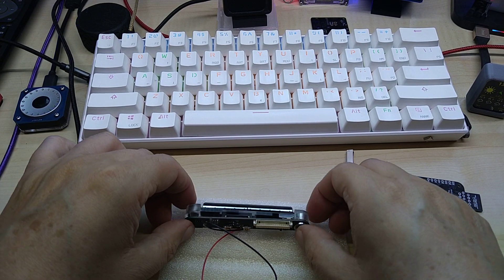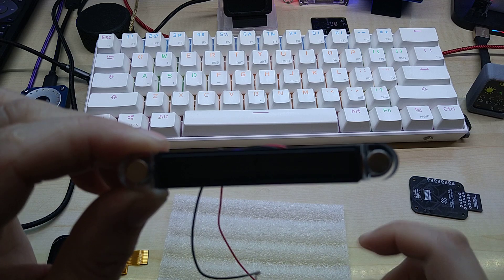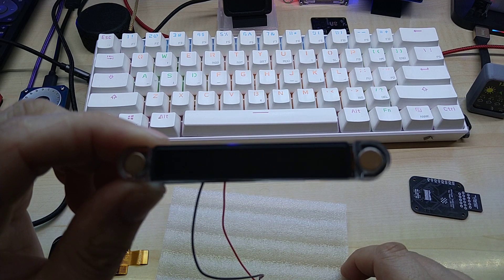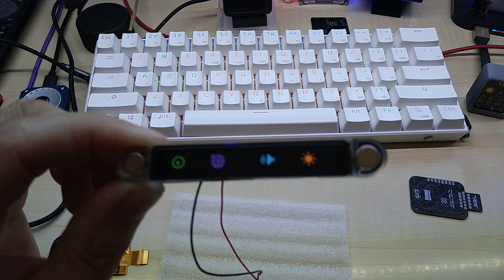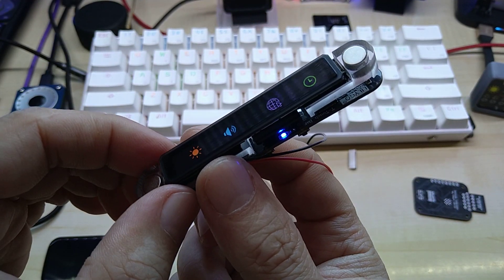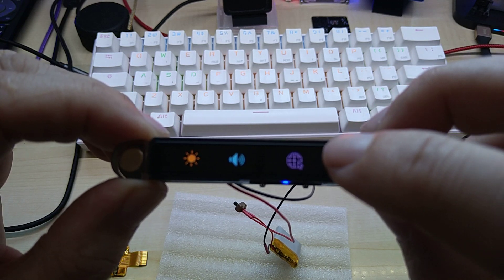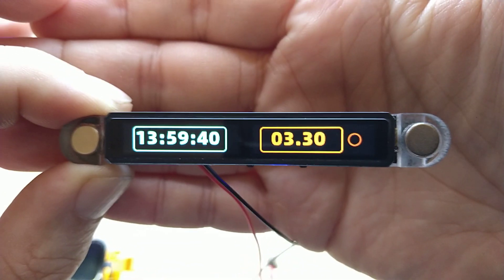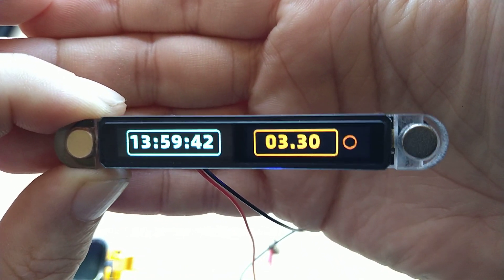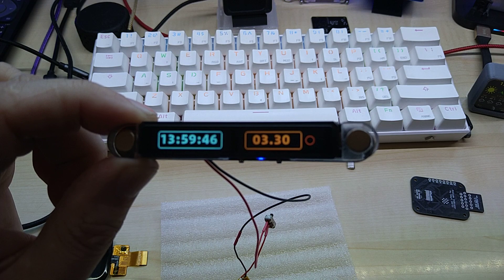So that's it for today — a small update. I also noticed I don't like how the backlight initializes before the display; you can fix that in code by initializing the display first and then turning on the backlight, which I will fix. But it is nice and bright now. Thanks for watching and take care everybody!